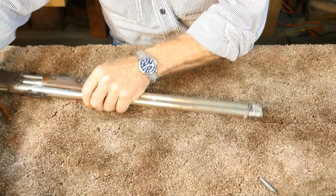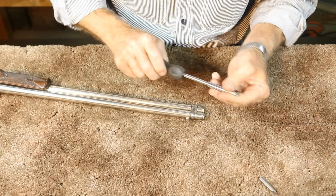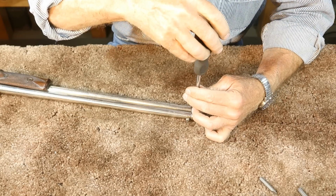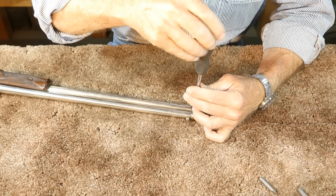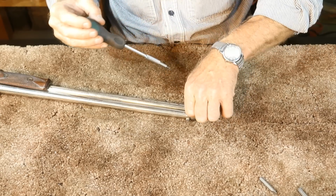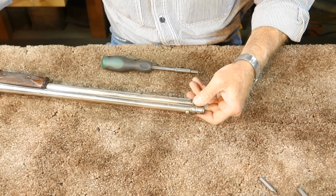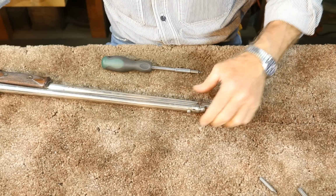Then the next thing, on a carbine like this, we need to take this barrel band screw out. And some of these are boogered up pretty badly. This is a very tiny little screw, and even smaller on a baby carbine because they're a little smaller barrel band. That one came out all right, and doesn't seem to be stripped either. Most of them are stripped. I'd say at least half, but usually I think even more than that.